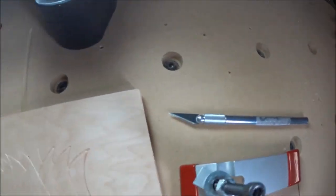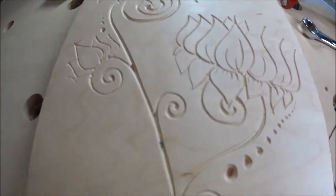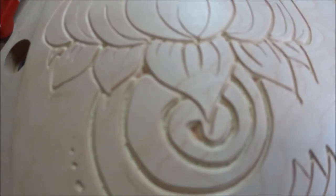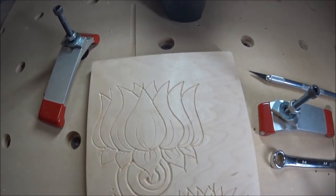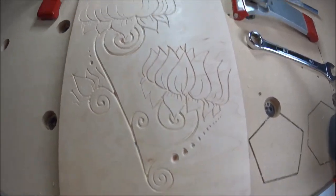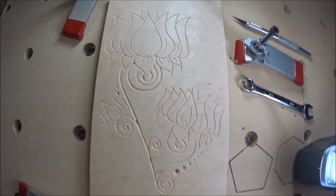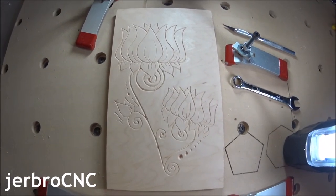I did take an X-Acto blade and drag it through some of the cuts that go into the second layer of this premium hardwood. What I found was that apple ply does have some softer inner cores — I thought it was hardwood all the way through. The softer material does have a bit of tearout unfortunately. But the overall design and the overall effect of v-carving this is really, really cool. Maybe this should be done on some solid wood as opposed to plywood. Anyway, I hope this was slightly interesting. Holly, excellent work. Until next time, thanks for watching.